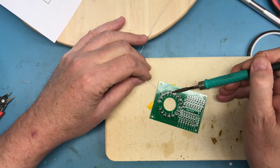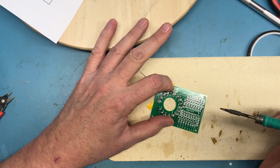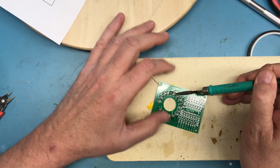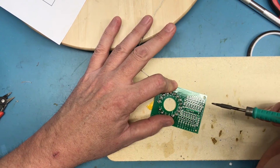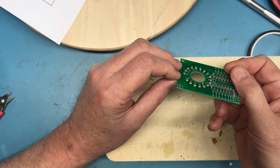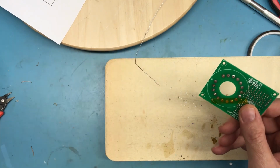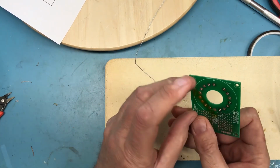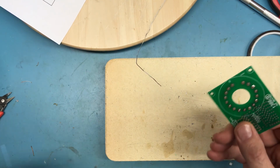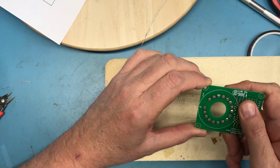Like the looks of this one here, I will add a bit of additional solder to it. That one's a little light on the solder as well. Take a look at the pins. They all appear straight. Tape. And because the Kapton tape is very heat resistive, it doesn't leave residue behind. Those look good from this side.